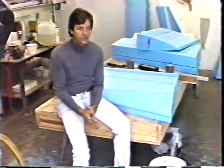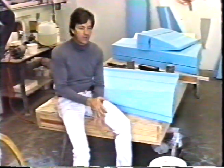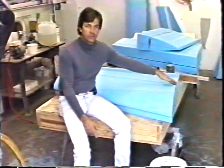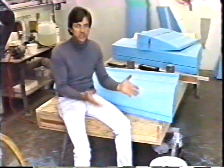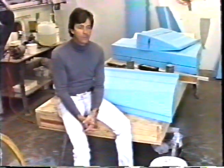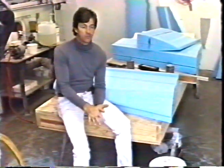So when you first get your wing cores, you take them out of your flashings, put them on their leading or trailing edges, and with the help of another individual, place a straight edge from one end of the wing to the other on this core down the spar cap trough. Find out which is the low side, which is the high side. If your wings are absolutely straight, then you needn't be terribly concerned about which side of the wing you do first. If they're absolutely straight, you can weight your wing cores down into their flashings on a dead flat table.